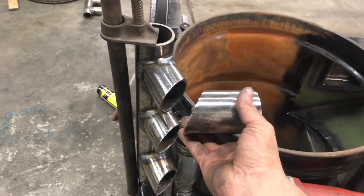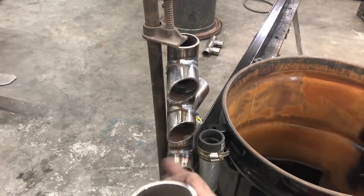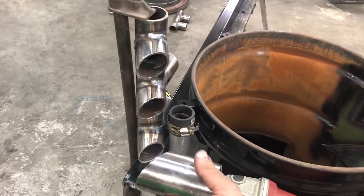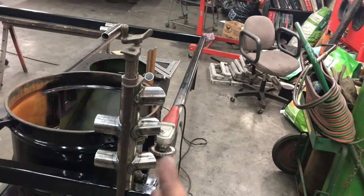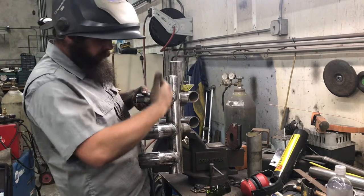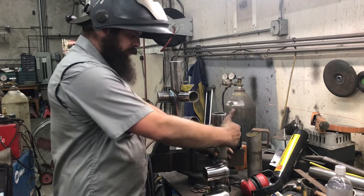I'm no pipe fitter, so I'm just kind of guessing. I got my angle pretty darn close, but also when you're doing a fish mouth like this, trying to line all of these up to be identical — I got them pretty close. I think this one's kicked just a tad in. So that means that angle is no longer correct as I cut it. I'm going to have to face that off with a flat wheel to get these to fit correctly and be completely the same all the way across the front. But I also think having that as a tube corner is going to look pretty neat — aesthetically pleasing at least. I want these corners to all line up with each other and then line up in the same plane so that when I place it on the rail, all these front tubes are in a nice even line and everything looks good as it transfers around the corner.